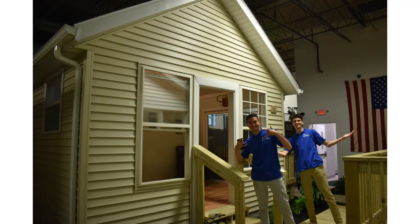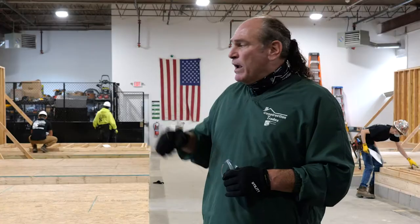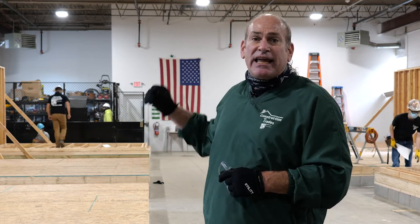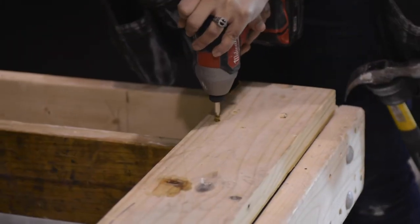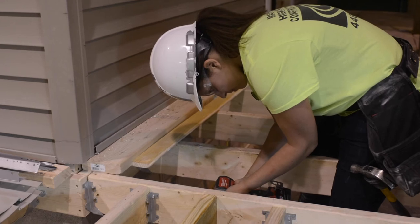We start right out with a block foundation — you can see on the bottom of these there's concrete cinder block. Once you learn about your concrete block and get it laid, we move right onto floor systems: installing anchor bolts, sill sealers, mud plates, and then our floor joist system. When the floor joist system is built and mounted to our foundation, it's ready to put the subfloor plywood on top.